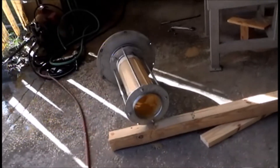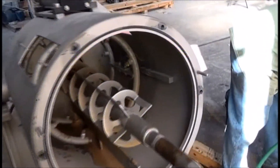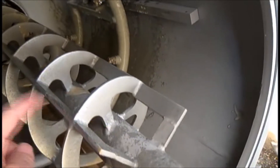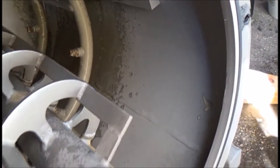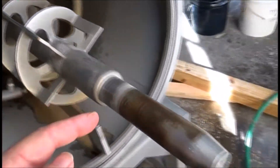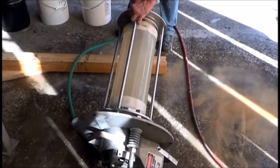We're going to try with a coarser sleeve. This is the inside of the machine. You can see our rotor right here — it has paddles. It'll splash the liquid against the sleeve. It has a ribbon flight that augers the solids towards the discharge down here. And so there's that assembly. We're going to try a coarser sleeve.